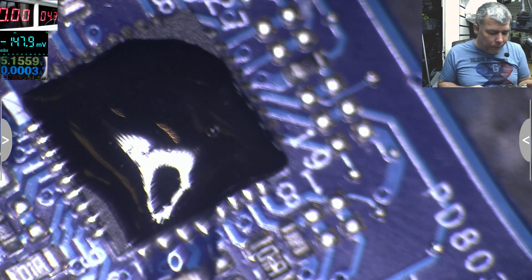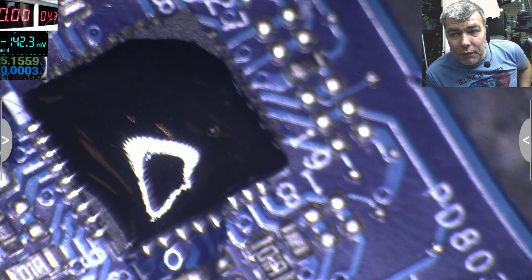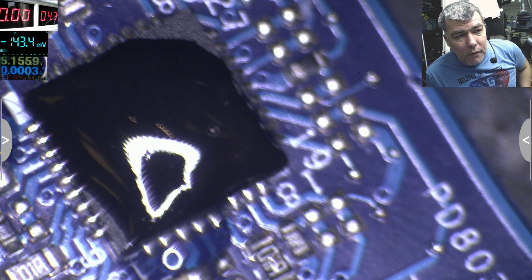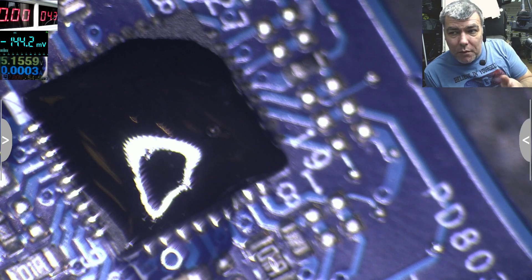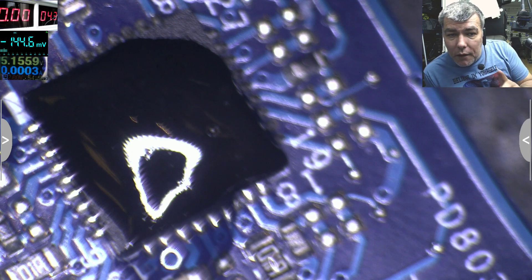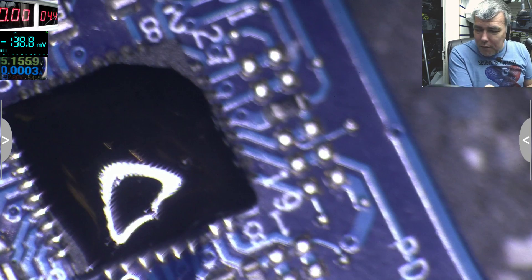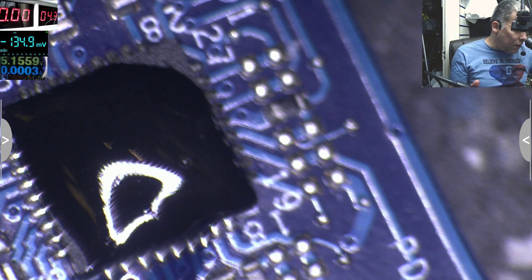It was pretty clear the fault. But I can't be wrong. I've seen some laptops with SuperIO running at 1.8 volts. So if you have a power rail at 1.8 volts and you come in with 3.3 volts, something will get hot — and it won't be the SuperIO. It will be the power management chip, which probably has a protection against high voltage. That protection will get hot — it's like a Zener diode. If you put a Zener diode, the Zener diode will get hot but nothing else will get burned on that power rail. Anyway, I think it's a standard 3.3 volts.